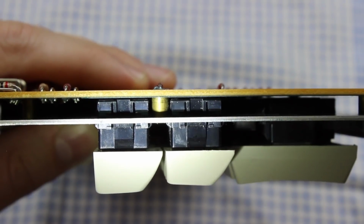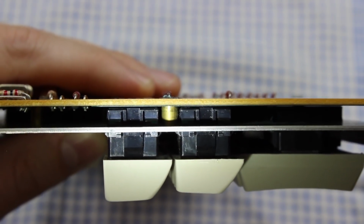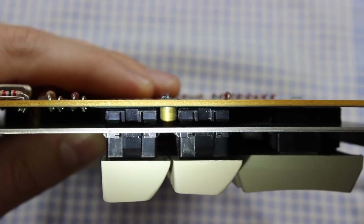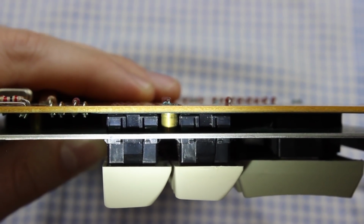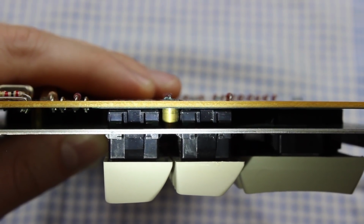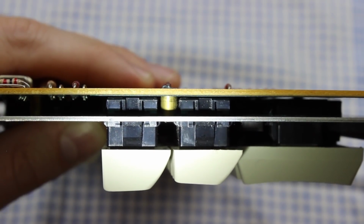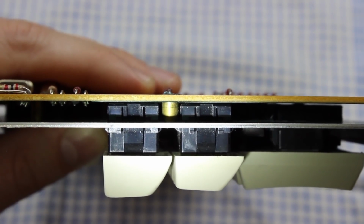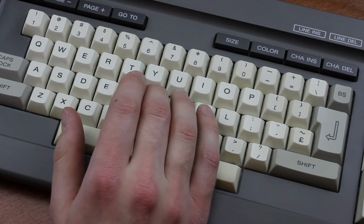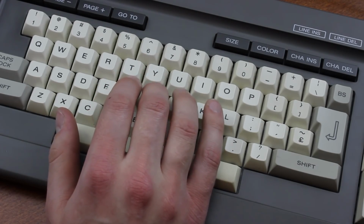Now herein lies the problem, because when it's mounted inside a keyboard, the PCB is held at a distance that's much shorter than how far the domes protrude if given the chance, so it never gets to fully invert. Basically, the PCB sits almost right against the switch bottoms, which looks like it's far too short to get the most out of the switch, because the snappiness is all in the bottom of the key travel, just like with the clickiness I guess. And as a result, when mounted inside the keyboard, the switches never show the snappiness that they do when used loose.